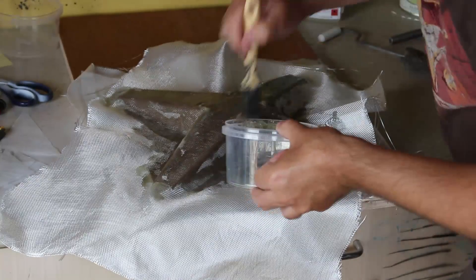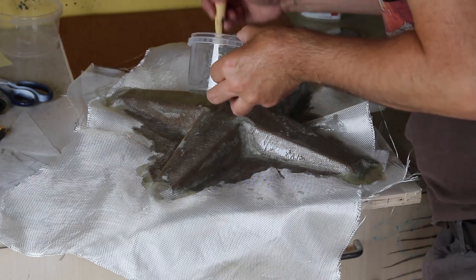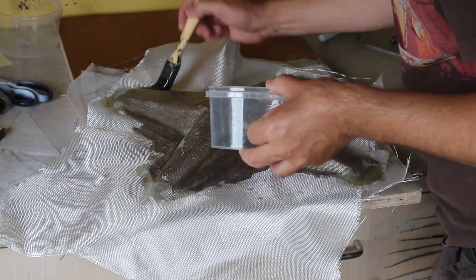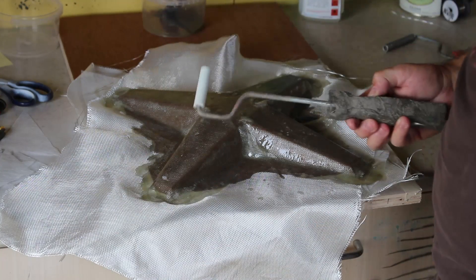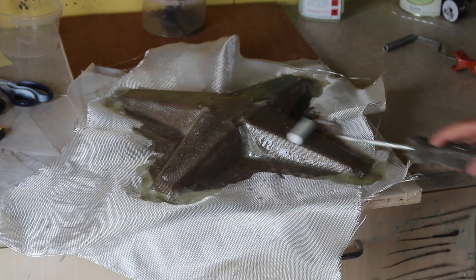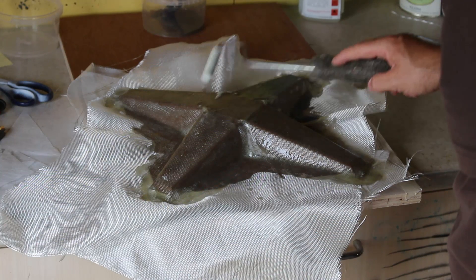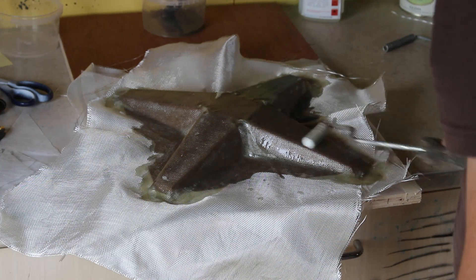There are a few bits I'd have a look at. These corners are awkward — I think I'm probably going to have to do this again and sort those corners out more. Now that it's nicely wetted out, I'm going to go onto the roller and just roll over it to push it all nicely down, get the resin nicely through, and hopefully get rid of some of these bubbles that have happened on the corners.